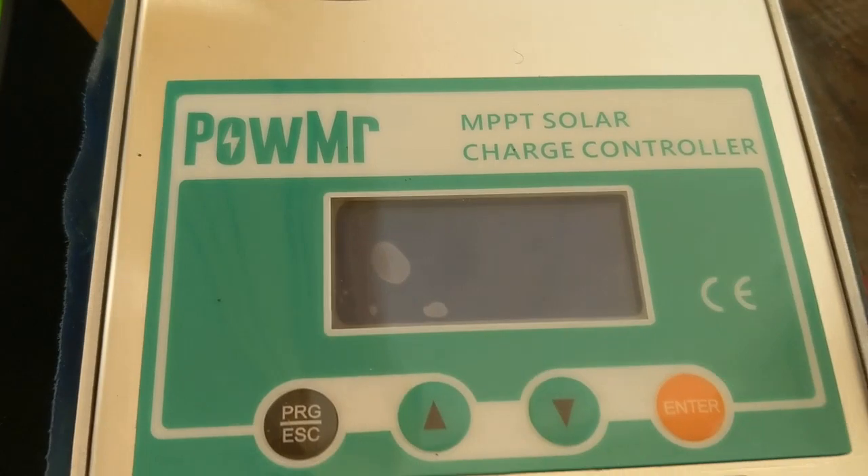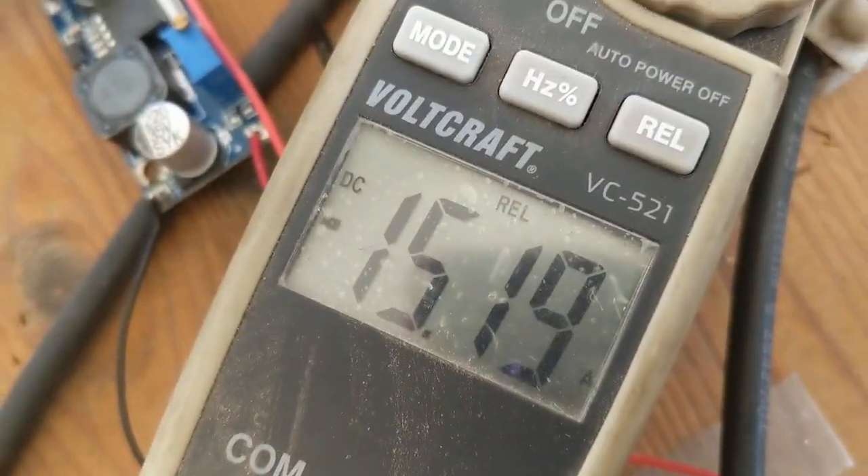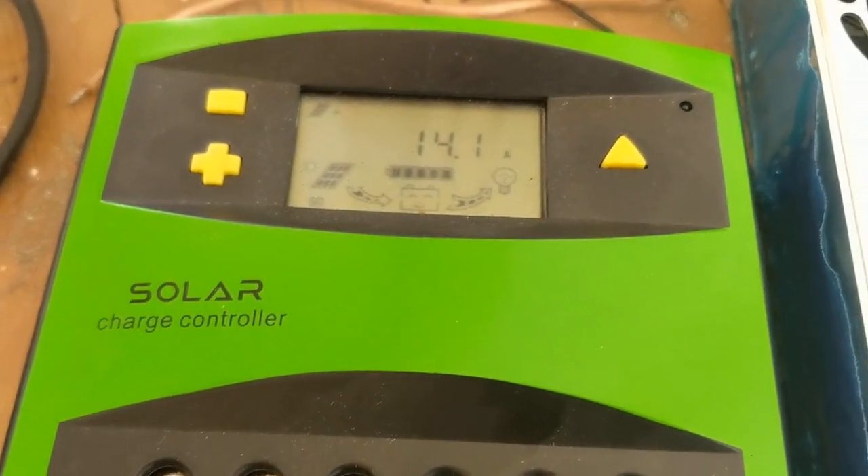With the shortcut, the reading jumped from 12 amps to 20 amps. So 12 amps showed up here as 10 amps, and 14 amps showed up as 15 amps. The key point is: if the solar panels match the battery voltage, you don't really need an MPPT controller. Most 60-cell solar panels are quite close to 24-volt systems, with an MPP around 29.4 volts, whereas newer solar panels have MPPT at something like 34 volts.